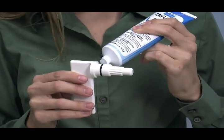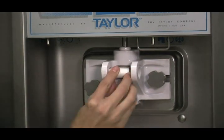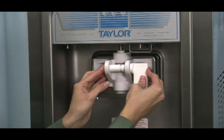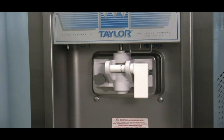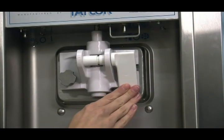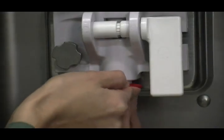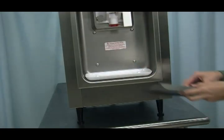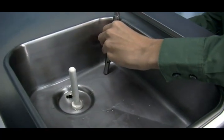Slide the O-ring into the groove on the draw valve handle and lubricate. Insert the valve lifter arm through the slotted opening in the draw valve. Insert the draw valve handle through the opposite cross hole and into the opening of the valve lifter arm. The draw valve handle can be assembled at varied vertical positions — choose an angle which is comfortable for you. The draw valve must be raised completely when the draw valve handle is down. Snap the design cap over the bottom of the freezer door spout. Assemble the drip tray and splash shield. Lean the feed tube against the side wall of the mix hopper.